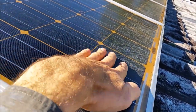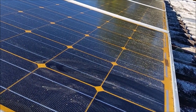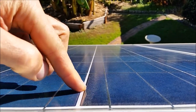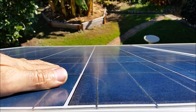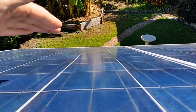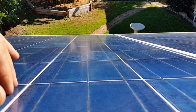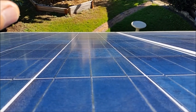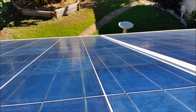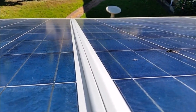As you can see, the dirt here is quite significant and it reduces their efficiency dramatically. The more angle on solar panels the better — a steeper angle is better because when the rain falls on them it tends to wash them better, as the runoff is faster. Ideally in this climate it would be 26 degrees. We are in southeast Queensland. If they are laying more flat you will need to wash them more regularly.